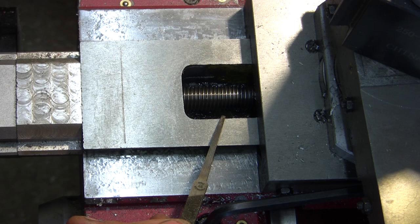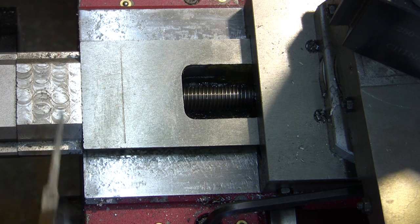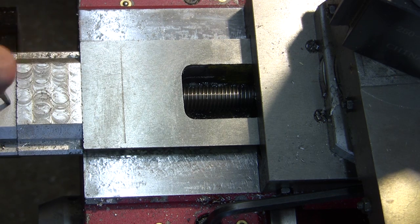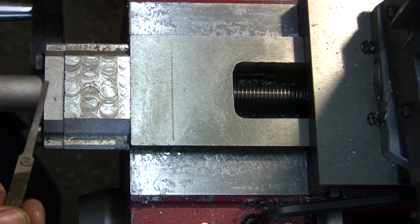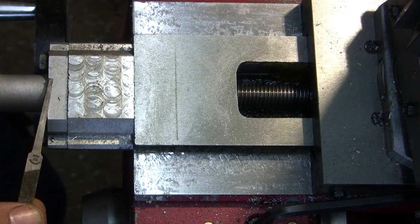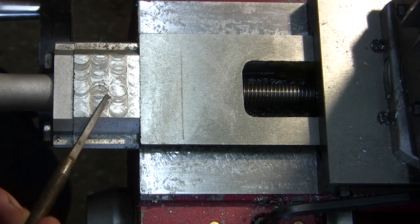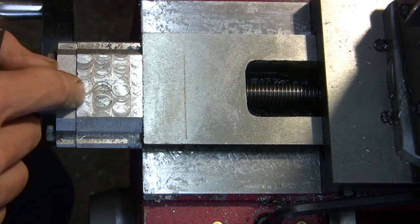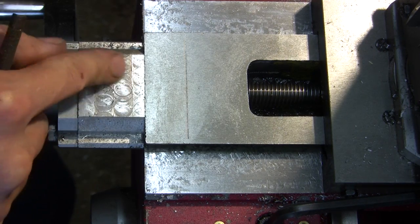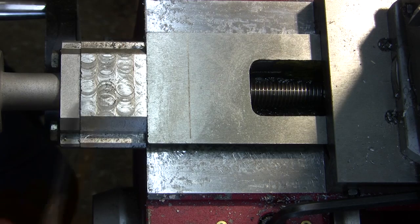It's not a very hard thing to do. I machined this to match the basic profile of that — it doesn't match exactly, but it's only for looks. I did get a bit of a crappy surface finish on it, but I didn't have a fly cutter at the time to get a better finish — it was basically the end mill that I had at the time.